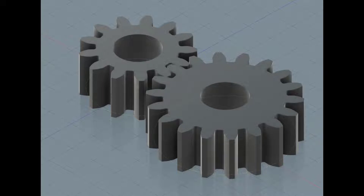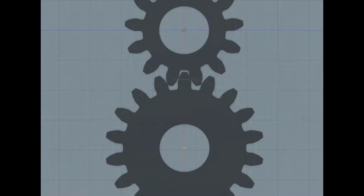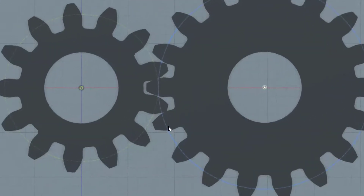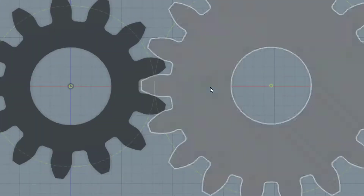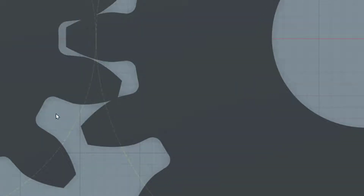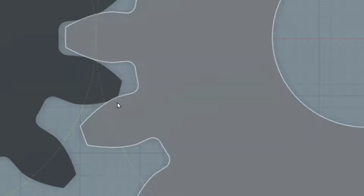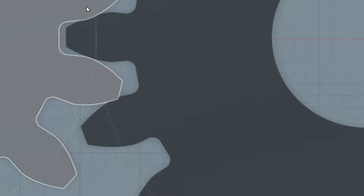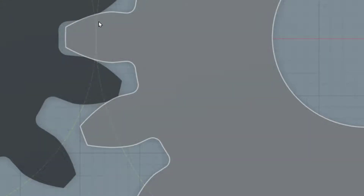When you start building gear trains you want to bring gears together. This is an example of two metric gears at a module of 1.27, a pressure angle of 20 degrees, with a 13-tooth gear on the left and an 18-tooth gear on the right. When trying to bring these two gears together so their pitch circles are just touching along the line of centers and then rotate them into mesh, you simply cannot do it — this corner is crashing over the tooth face on the right gear, and the face on the left gear is crashing over the tooth face on the right gear.